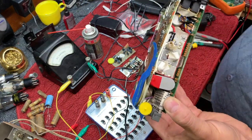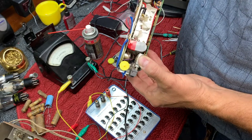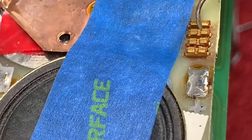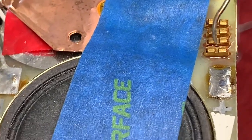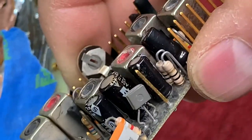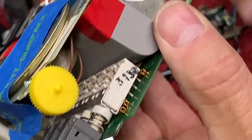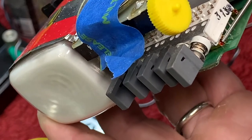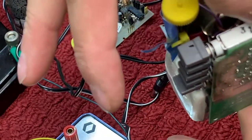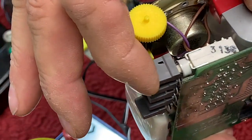I'm going to zoom in so you can see — right here, this Berg connector, right in there, has a little flat piece of gold that comes in contact with these pins. Those are very fragile, so you have to treat them with kid gloves. I'm also going to spray the switch right in here, and spray this volume control knob.